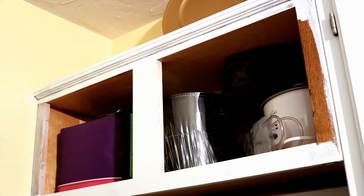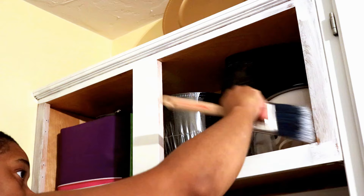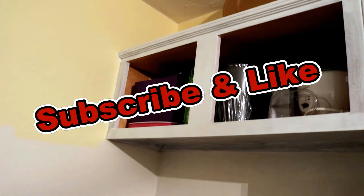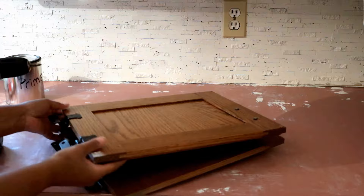Making sure to stress: priming is always key to making sure you have durable cabinets. I know a lot of things you will buy say you don't need to prime — don't listen to them. Get some primer, and any type of brush will be perfectly fine for starting off your cabinet renovation. It's always important to prime all areas, even areas you may not be able to see, like behind appliances. A refrigerator is so easy to move — most times just slide it out and prime those areas and underneath the cabinets as well.